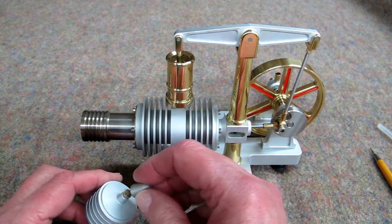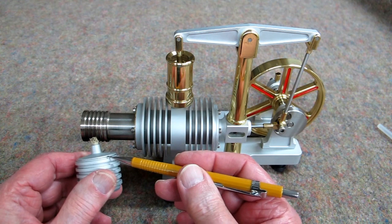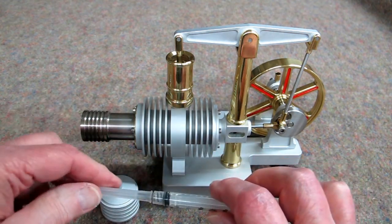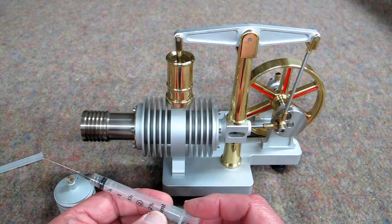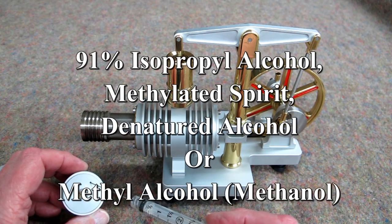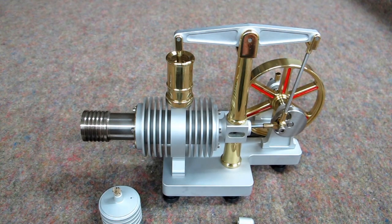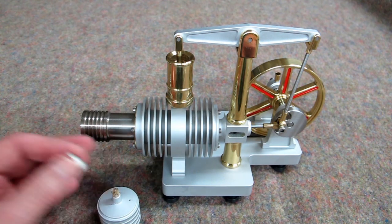The alcohol lamp — this little cover keeps your alcohol from evaporating. This is made with an O-ring and it's a real pain to try and get that lid off. I suggest that you do not mess with that. Go get a hypodermic needle — these are available in different places; this one does not have a point on it. This one holds three milliliters, and I put three of these in to begin with. It will just fit into this vent hole and you can put the alcohol in there. Don't overfill it. When you're done running it, you blow this out. This will get a little bit hot because of the reflected heat, and then you put that cap on there.